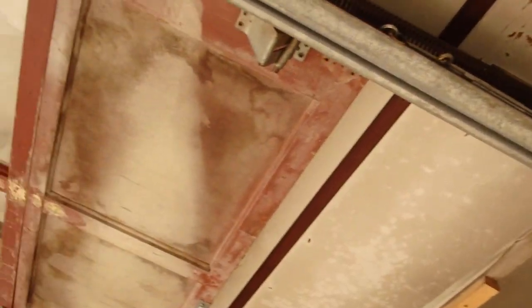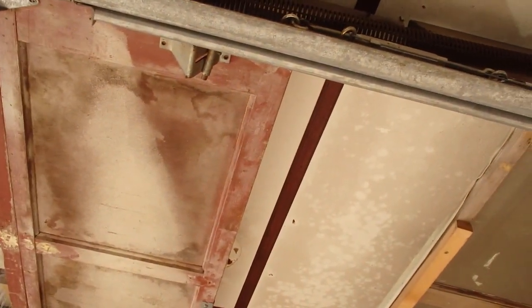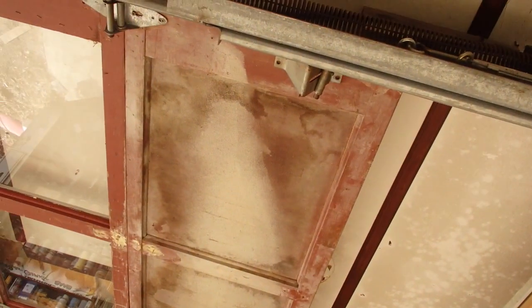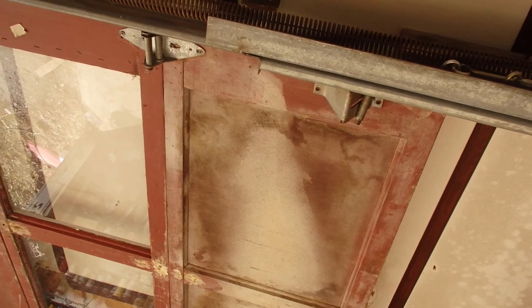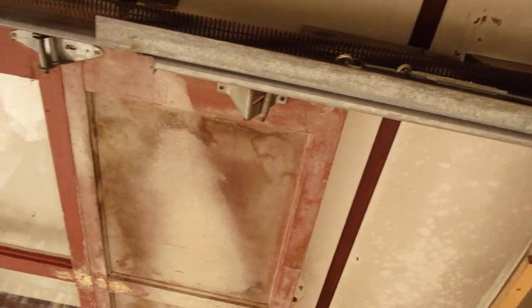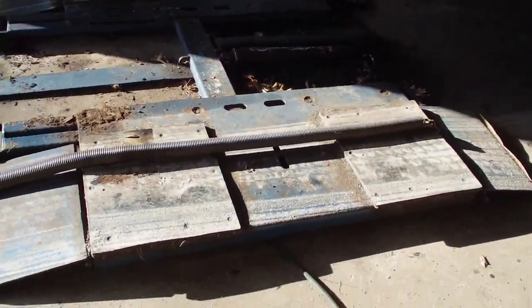See, there's a lot going on here. There's a safety factor in this thing. There's a cable that runs inside of that spring, so if that spring ever breaks, it won't drop that down on you. And you have to redo the cable and everything, and you have to get it up there in the right place, because that spring won't bend, so the spring needs to not stretch out any further than the end of the door there. Yep. So that's that project I was talking about taking on that I might take on next.